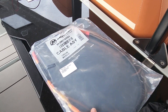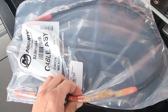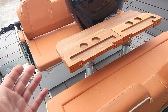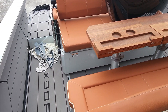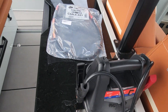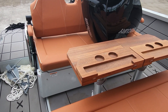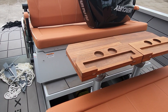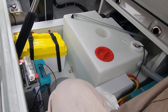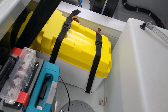There's our jumper box. There's our cable I was talking about earlier. See, there's a fuse right in line right here. You can't replace it without replacing this cable because it's all heat shrunk in here. So hopefully that's the case, but we're gonna look right now before we start it. I wanna find the batteries and pull the covers off, check our connections, find which battery is weak so we can jump it. This thing probably doesn't have bad batteries — it's got 25 hours on it. It just hasn't been charging.